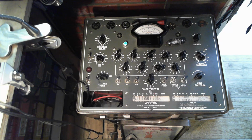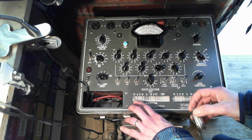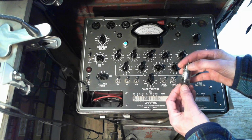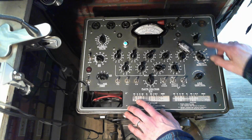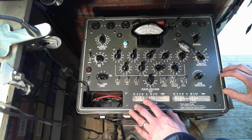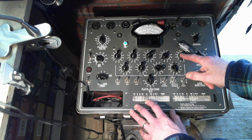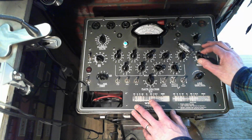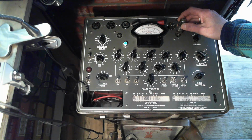Okay, good news on the testing front for this tube. The ECH 81 is right there on my chart list, the North American version, 6AJ8. So I set this up for a 6AJ8. Let's just double check. Signal level 4, 15L, I think L stands for low. 0176, 0035, 46, D. Okay, we're ready to go.